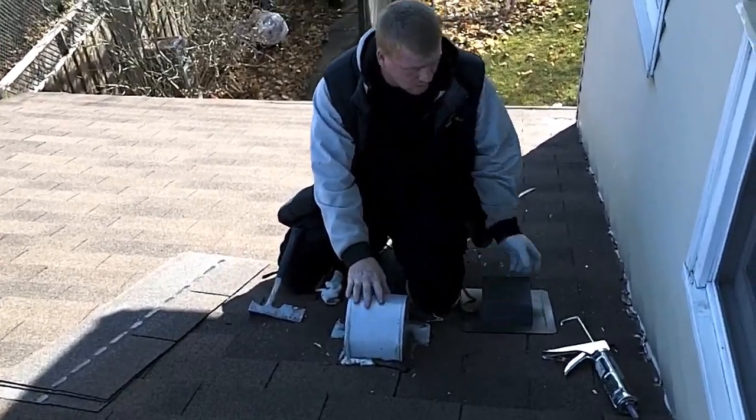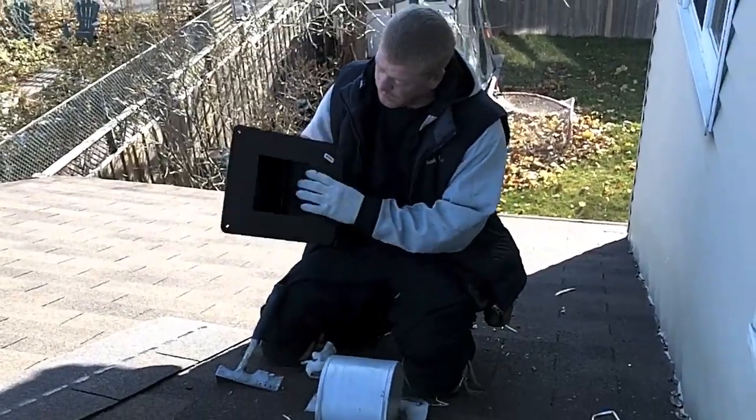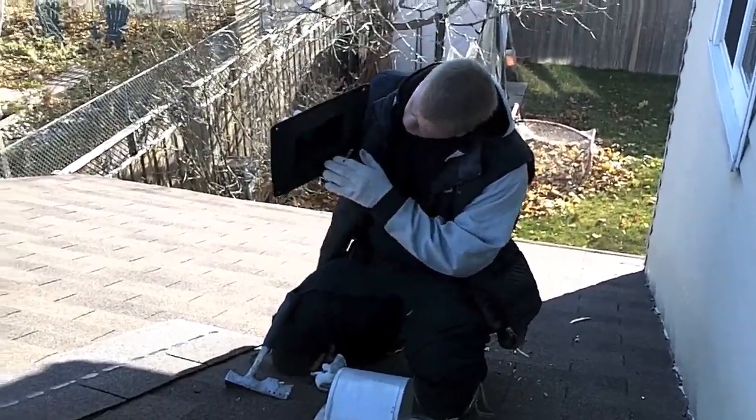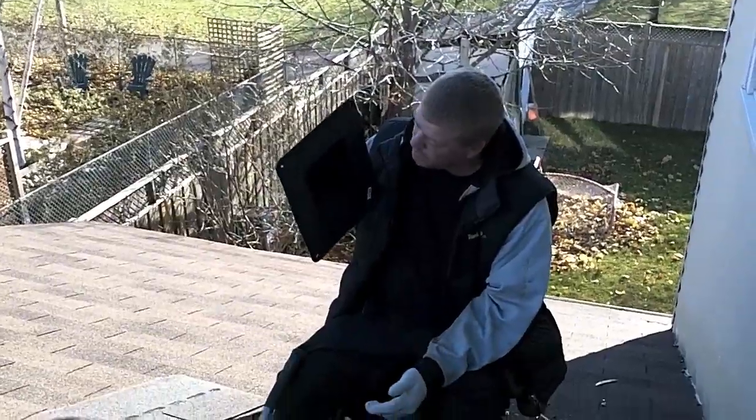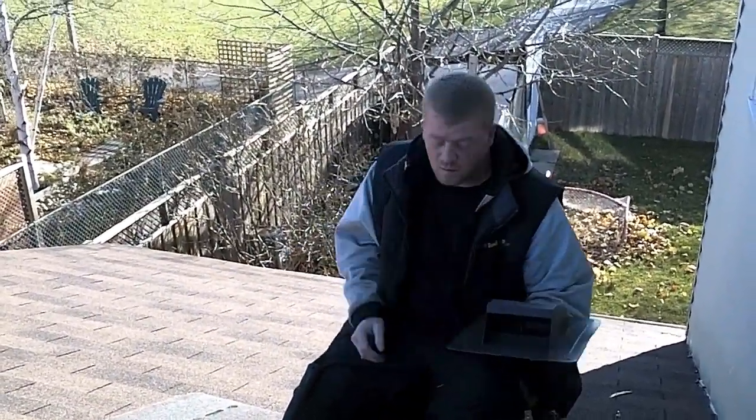What we want to do is take this out because it's leaking and put this in. This has its own blow cap on it — it's actually closed when it's not being used, and when the fan comes on, it opens and allows the air to blow right through.